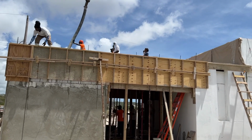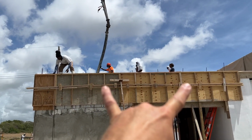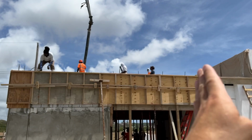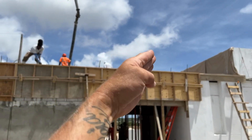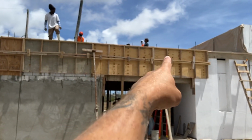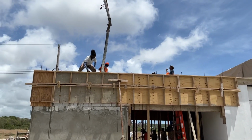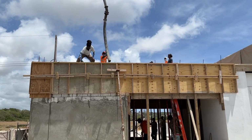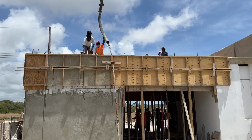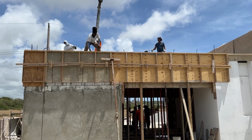So yeah, what they're going to be doing at the moment, like I said, they're going to be taking an 8.5 inch concrete at this side, and all of it's going to be running that way. So that's going to go down that side, that's going to go down that side, the corner's going to go to corner, and the side's going to go to sides, all aiming for that far right hand corner. So the lines are all in there. We've asked them to leave the lines in, and then that way they can use the lines to make sure they get the runs 100% correct.